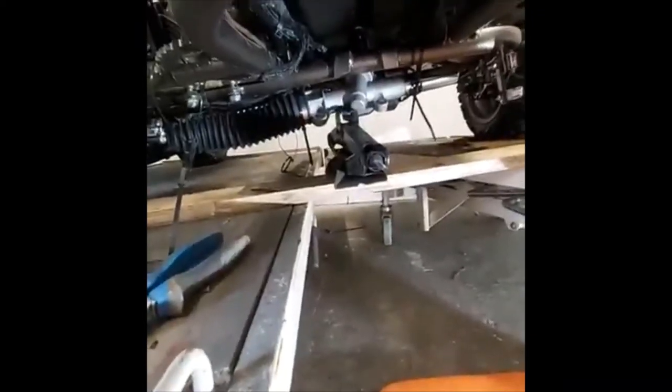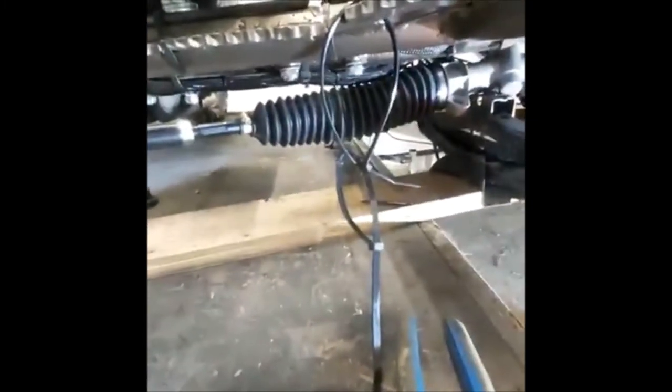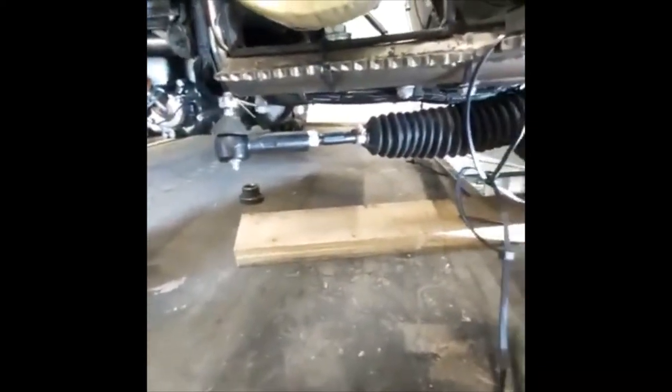Down on my knees here — you can see underneath — that's the steering rack there in place. It's very loose, not bolted to anything, just cable-tied and the jack is holding it up. What I'm going to have to do now is make up brackets and get this welded in. This section here will be coming off the end of it, and I'll get an extension rod of whatever length I need to fit up with the bracket. There's a lot of work involved in getting this right.